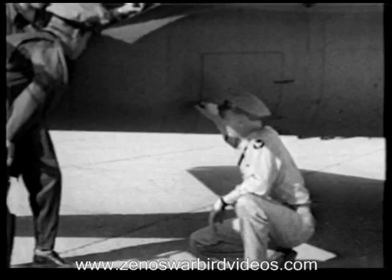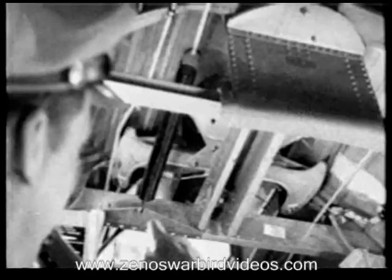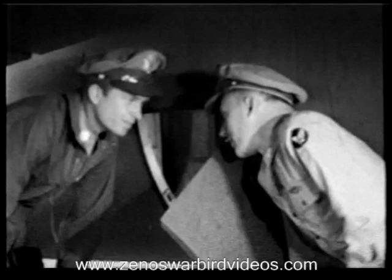If it's on the airplane, you can see it easiest through this tail gunner's hatch. You see it up there in the elevator control arm? Yeah, don't all B-17s have them? A lot of them do, but you should check to make sure. Downspring will affect the trim of a ship, especially on landing.